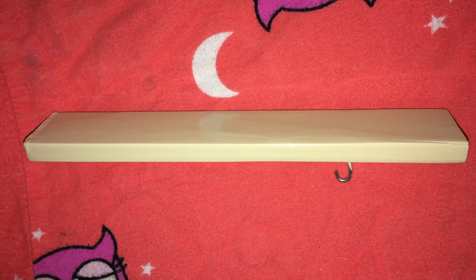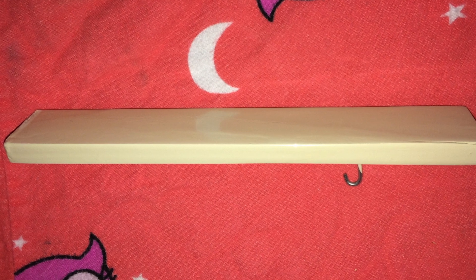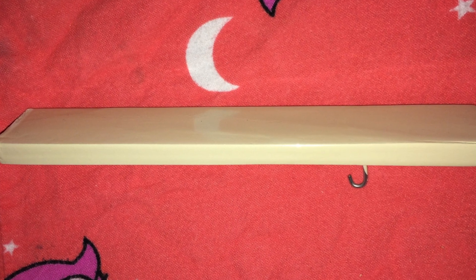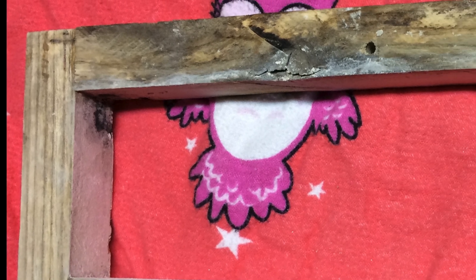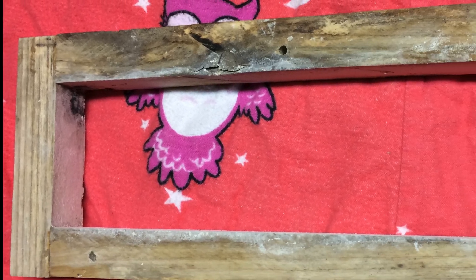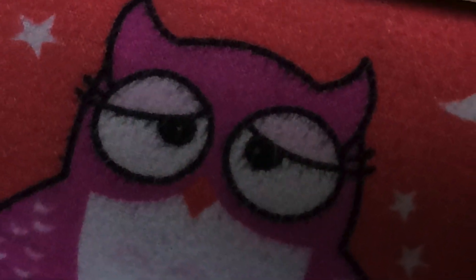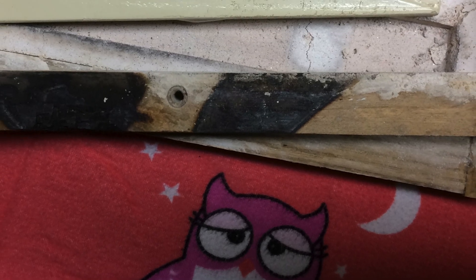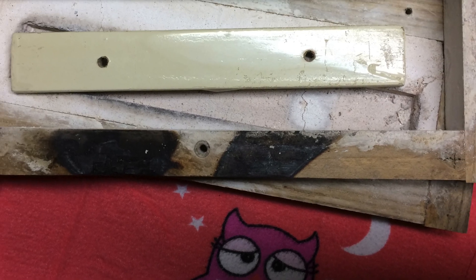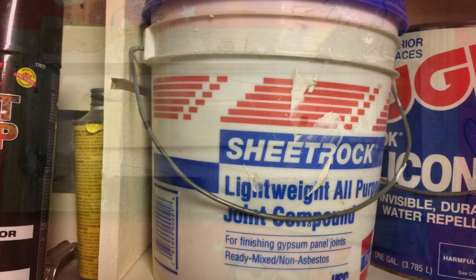First I made a wooden pattern, then I sanded it and painted it smooth and glossy so it would be non-stick. Next I built a set of simple top and bottom mold frames, called cope and drag, out of some scrap wood that would be long enough to make the largest bar pattern I would need. I first tried pouring plaster and sand mix around that, but it would get stuck and damage the mold getting the pattern out, so I patched it up with some spackle.